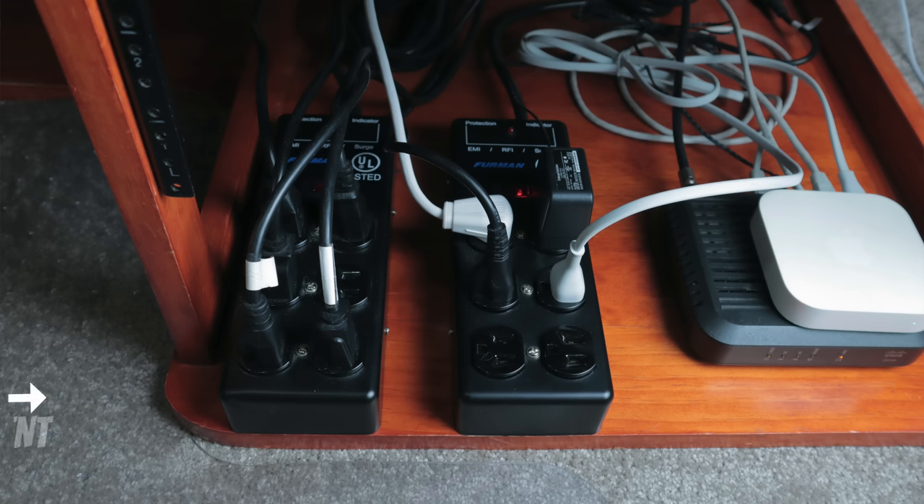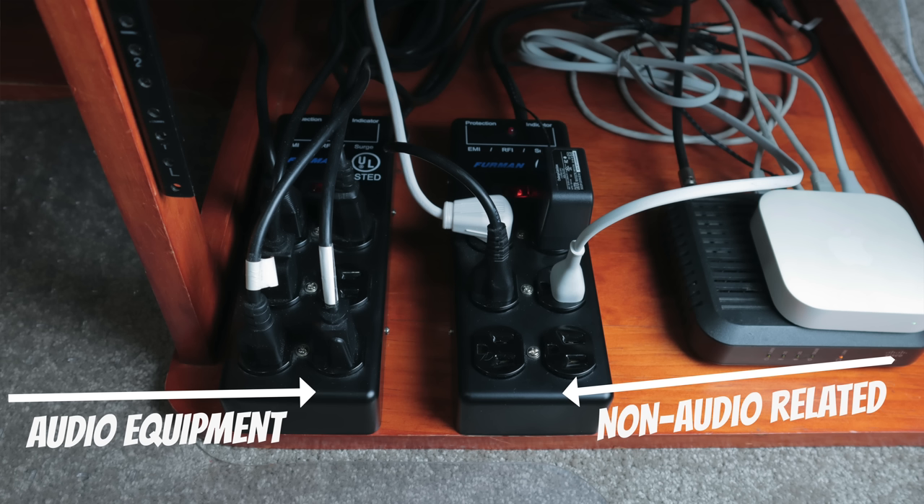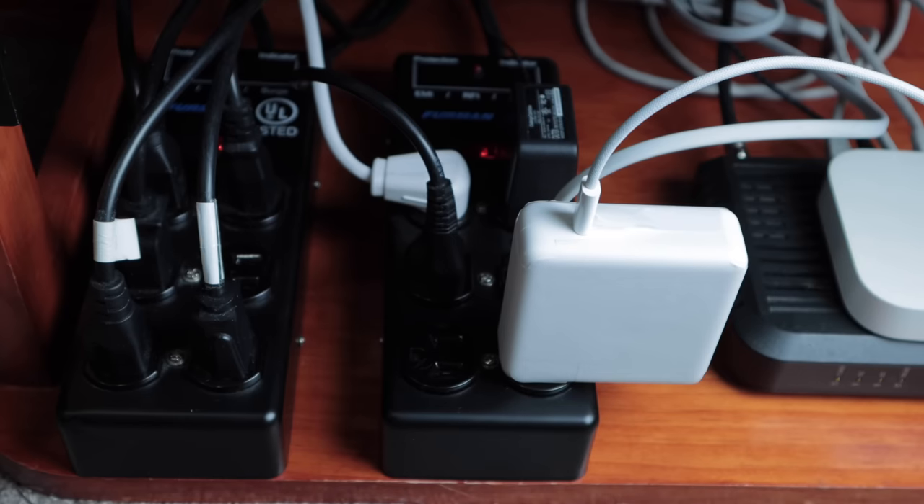This solved two problems that I think a lot of you out there are dealing with. Put all of your audio equipment — including your interface, your preamp, any analog gear you have, your studio monitors — all on the same power strip. Then everything else that's not related, like your laptop AC adapter, goes elsewhere. I had accidentally plugged my camera AC adapter into the power strip I'm using for my audio gear, and I started to have this weird whizzing, whirling kind of noise in my audio signal. As soon as I unplugged that camera AC adapter and moved it to the other strip, it went away. I have two of these identical Furman SS6Bs — I'll put a link in the description. They're nothing special, but they're quiet and don't produce any hum whatsoever.